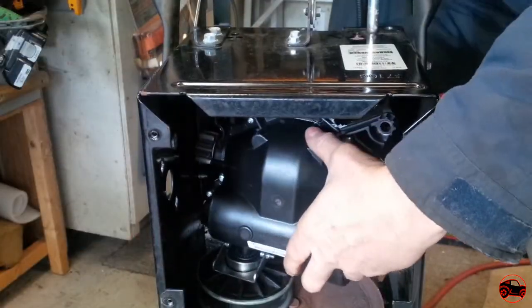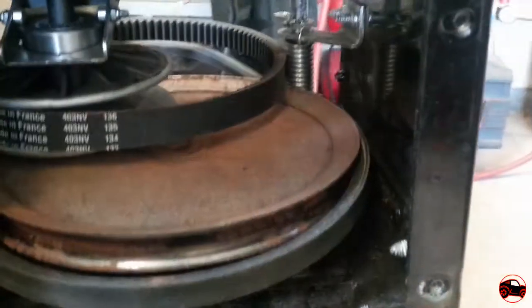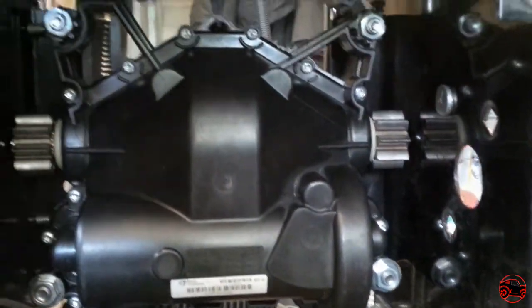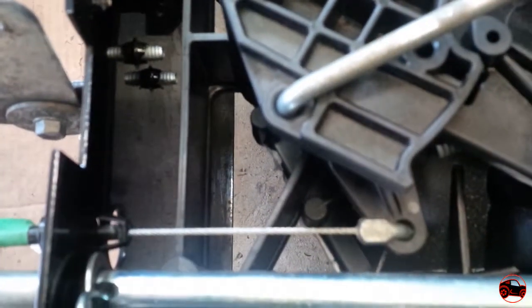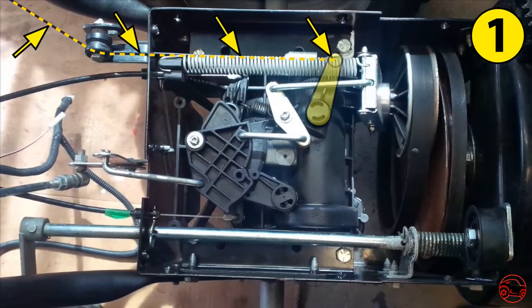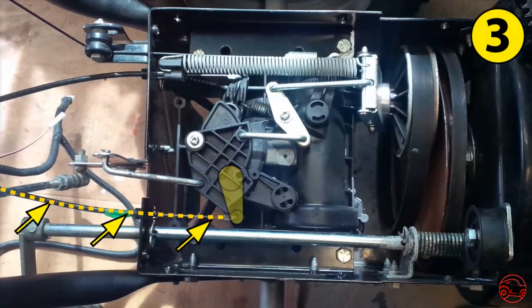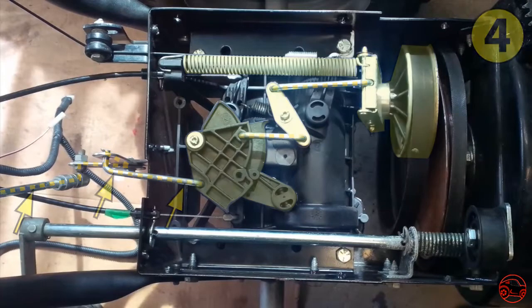Because I had removed many parts when working on my snowblower, I had plenty of room to put the transmission in place. It is very important to install the belts before the final installation of the transmission. When the transmission was well installed, I tested if the wheels were turning properly. I show where I installed the cables and the rod to control the transmission. Four systems are used to control the transmission: one, the cable to engage the clutch; two, the cable to disengage the left wheel; three, the cable to disengage the right wheel; and four, the rod to control the forward speeds and the reverse speeds.